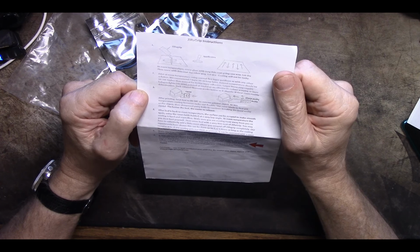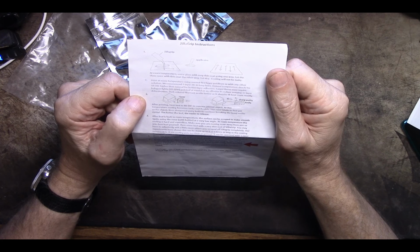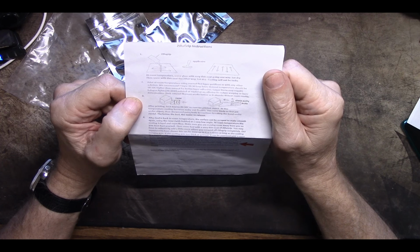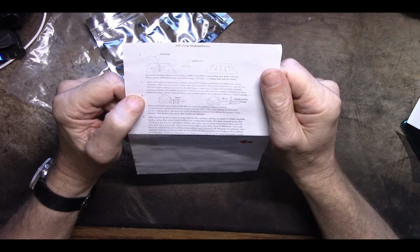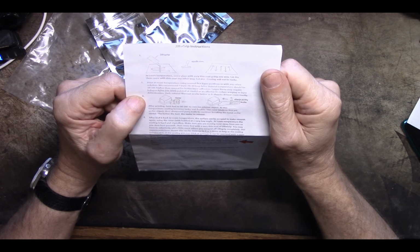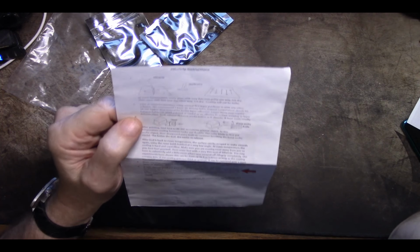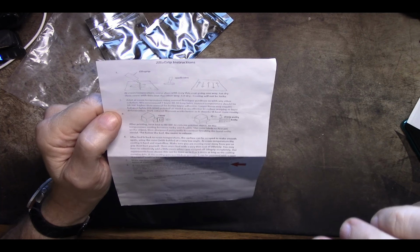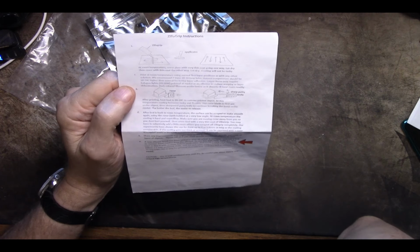Print at room temperature using normal first layer guidelines as with any other solution. We recommend 2-layer 20 to 30 loop brim. Hot end temperature should be 10 to 20 C higher than normal for better layer adhesion. I'm not sure what that could possibly have to do with their solution. Layer adhesion is between layers, so that one's kind of new to me. Larger items may require halogen lights, 20 to 30 watt, pointed at model or on effector to reduce warping or layer delamination. Dark colored filament works better as it absorbs IR heat. Well, I only have the white because I only wanted the white.